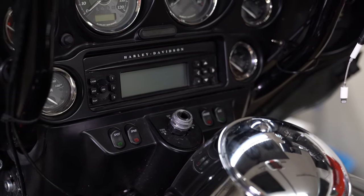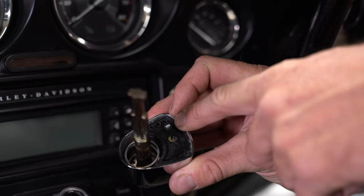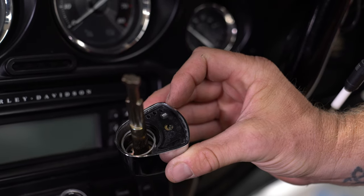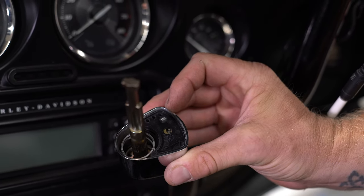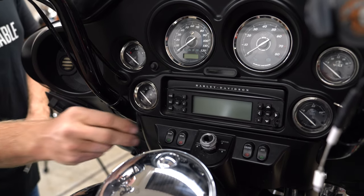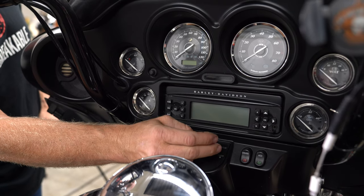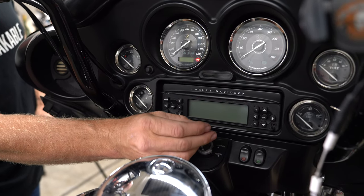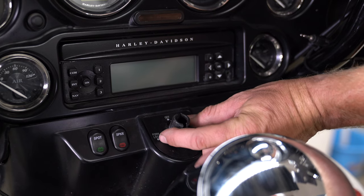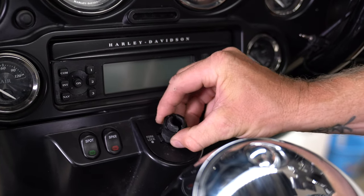I'll link to that in the description below. Just because you couldn't see it when he was taking it off, he's going to point to it — that's the little button on the very bottom that you're going to push up on. It's in the up position because the key is in it and we took it off. When we put it back on, we'll release it with the key and that'll snap back into position. With a 7/8 inch wrench, he's just removing the top nut or collar. If you don't have that big a wrench, just use some channel locks. Just be careful not to mar it. Then he just takes that off the top there. There's another piece below it, and it can only go back on one way, so just pull that off. And at the very bottom there's another plastic collar — it can only go back on one way, so slide that off.